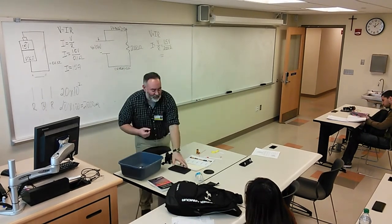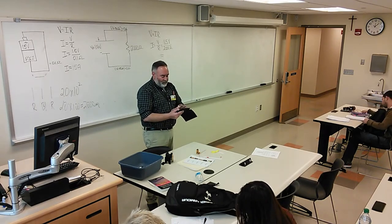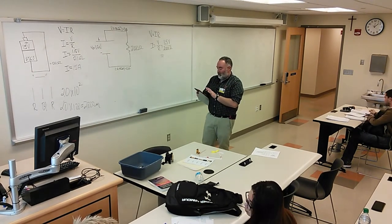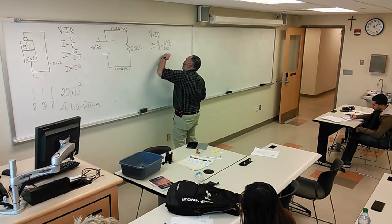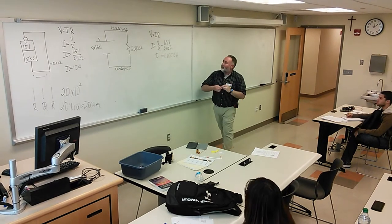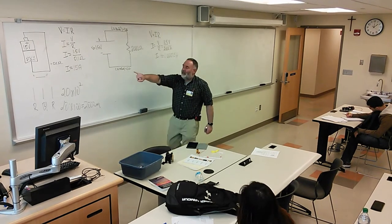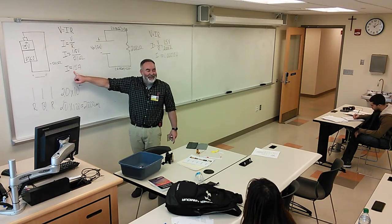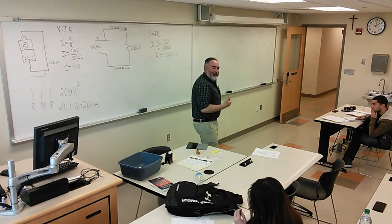And I wish I was smart, but I am not. Did anybody do that in their head? Calculator. 1.5 divided by 2,000 is 0.00075 amps. That's the current, okay? A little bit smaller than this guy, right? 2,000 times smaller. So if this guy drained in 1 minute, this guy will drain in 2,000 minutes.